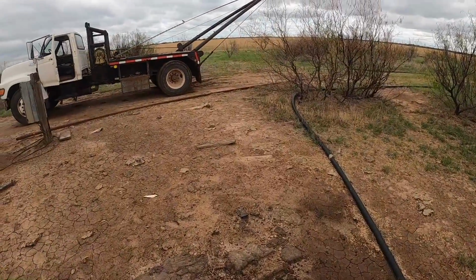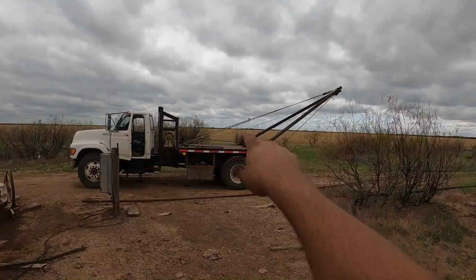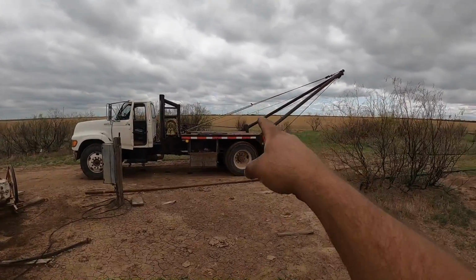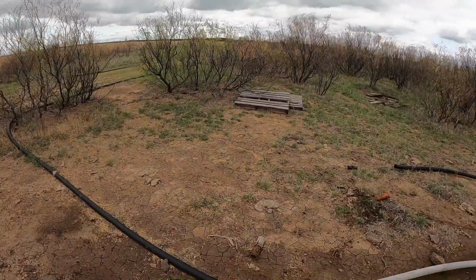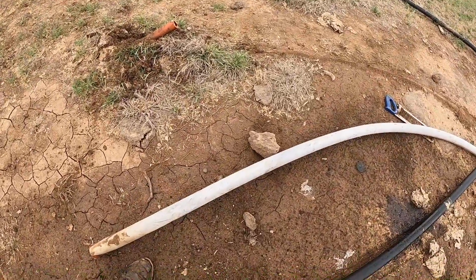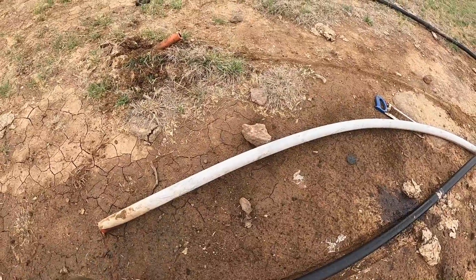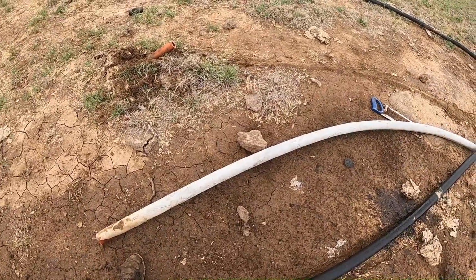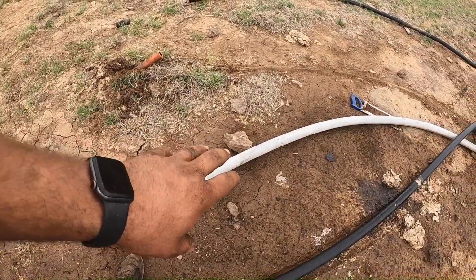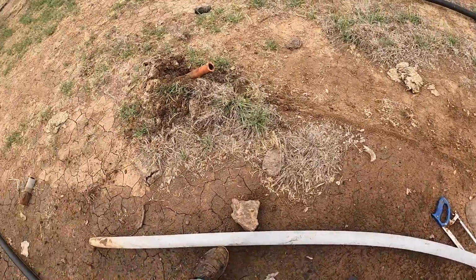So the well, can you see the well? It's right over my truck, right over the poles. It's got a poly line. It's buried across the pasture and pops up right here. Now it's this old orange poly, and this stuff's got a bad rap for a good reason. If it's left out in the sun like this for a couple of decades or 3 or 4, it becomes rotten and it'll break. And probably if you bent this over here, it would actually break.